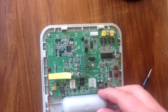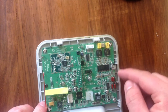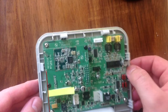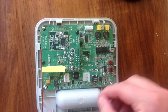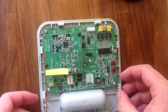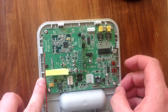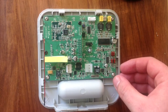The sad thing is the board is incredibly well made. As you can see there are test points absolutely everywhere - there's some more there, and there are some on the daughter board that serves as the radio receiver. Basically it's a very well made board for something that is meant to be thrown away. I was actually pretty surprised that somebody went to all the trouble of putting a mask on and labeling all the voltage points. After I tested it, it seems to work just fine - the LEDs on the front panel light up and the voltages at all the labeled test points appear to be exactly what they should be. It'll work a whole lot better than with a 1.8 ohm short on the power supply, that's for sure.